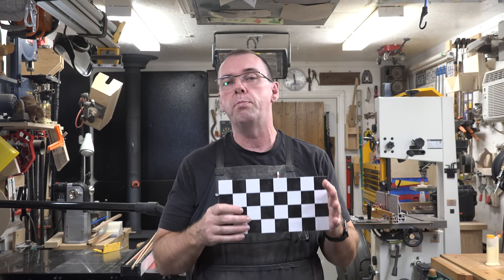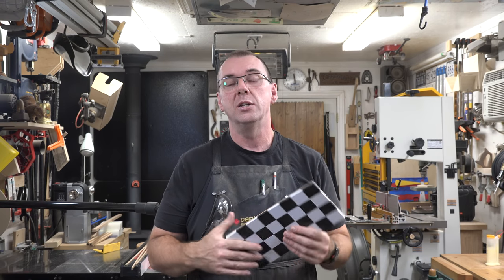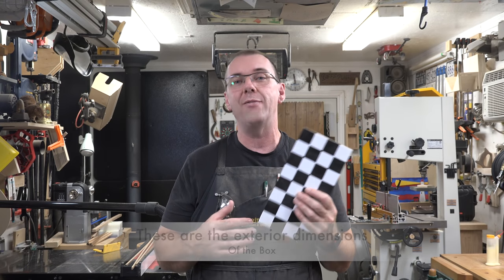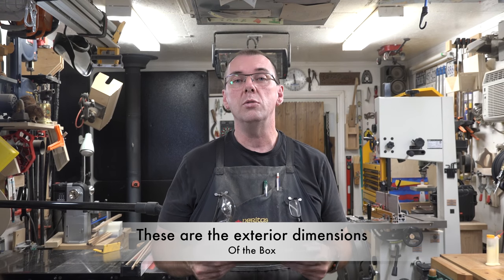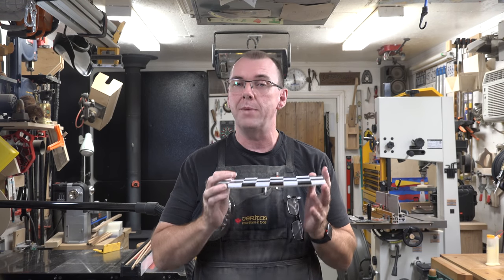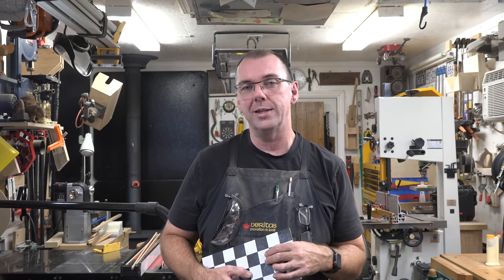You will measure your board and add 1/2 inch to the measurement, and that is the size of the box that you need. So if your board is 11 by 5.5, then your box needs to be 6 by 11.5. What we're going to use for this box is our Incra iBox jig. You guys don't need another demonstration of it, but what I'm going to do is cut all the parts to make the box, the dimensions that I just said to you, and then I will come back and see you after all that is done.